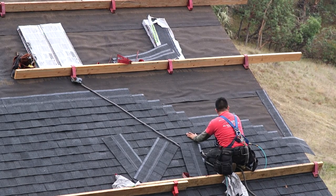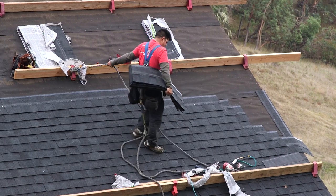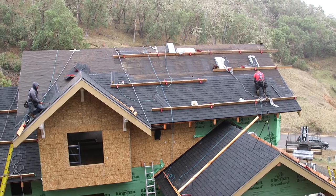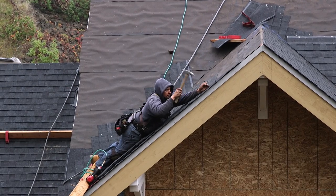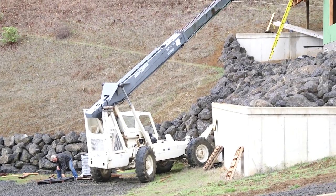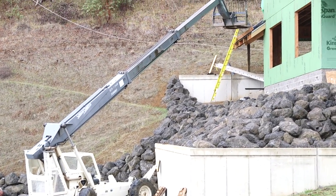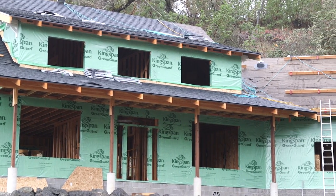Always remember the first and final rule of roofing is that water always flows downhill in the fastest, straightest route. And so, if the roofing is properly installed, the water will roll right over the top of all the shingles, never touching one of the nails or leaking through any exposed butt joint until it drops right off the edge of the roof.